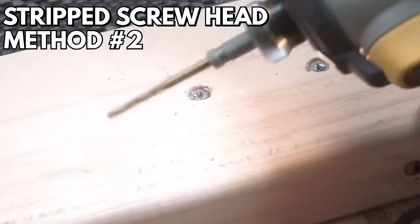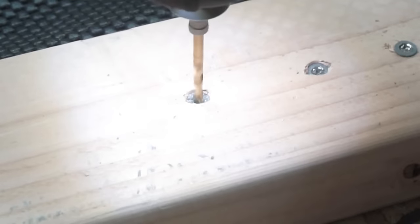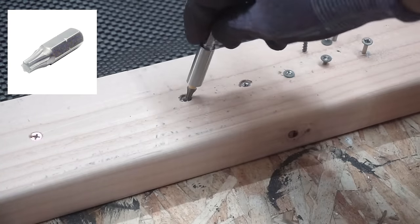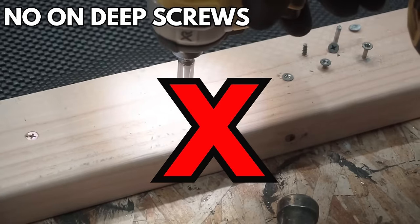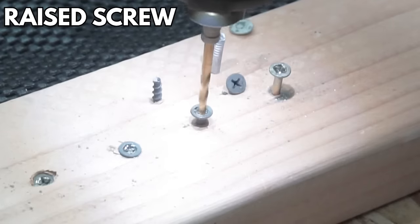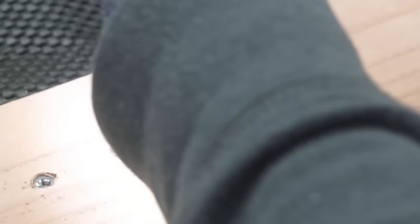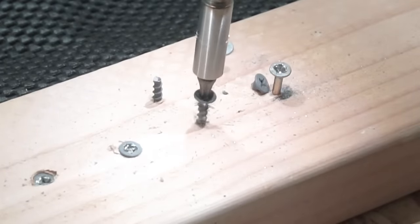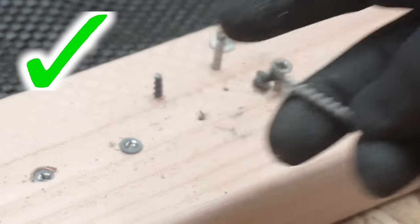The second method is using a drill bit. Depending on the size of your screws, make sure you take the right drill bit for your screw head. I'm going to use this star bit and my impact wrench, slowly drilling it out — so far it doesn't seem to work on the buried one. But for the raised screw, I pound the star bit in with a hammer so it's locked in, then use the impact wrench going nice and slow, and it actually works. Maybe if I'd tried the hammer method on the first one it would have worked too.